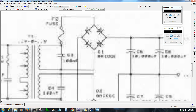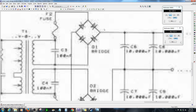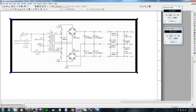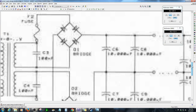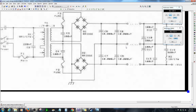This is the original design - it's a bit fuzzy and difficult to read. You can see the windings here: winding one and winding two. This one is feeding bridge rectifier one, and the other winding is feeding bridge rectifier two. The cathodes of the two diodes in the first bridge are connected to the positive rail, and the anodes of that bridge rectifier are connected to the second bridge rectifier. The two cathodes of the second bridge rectifier are connected together to create a ground.